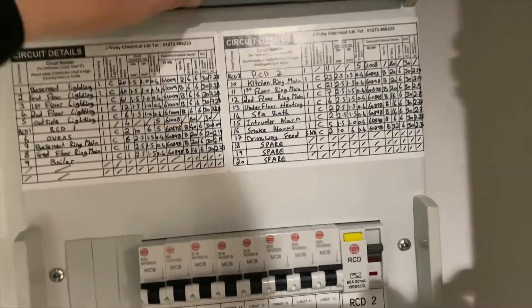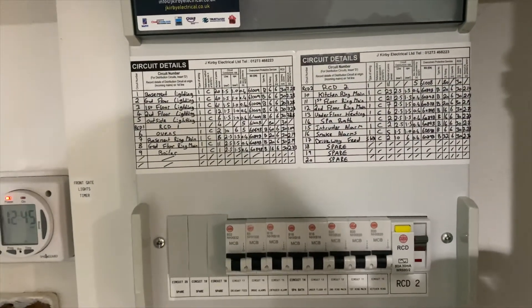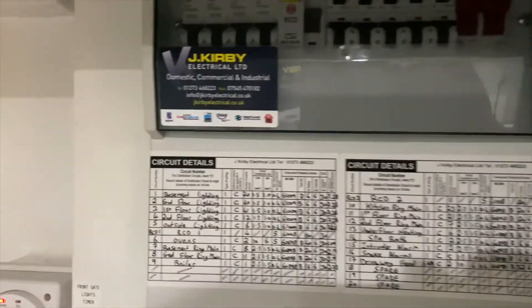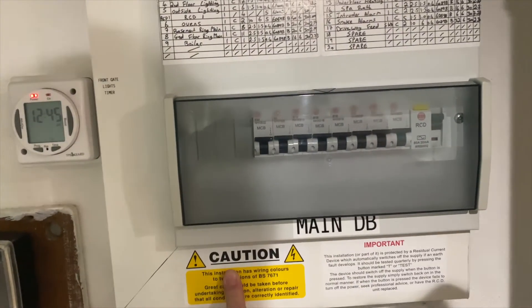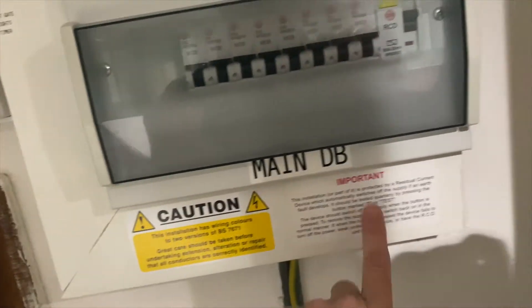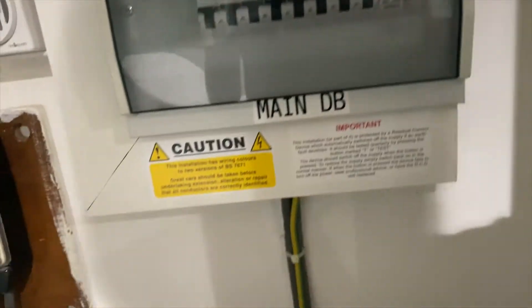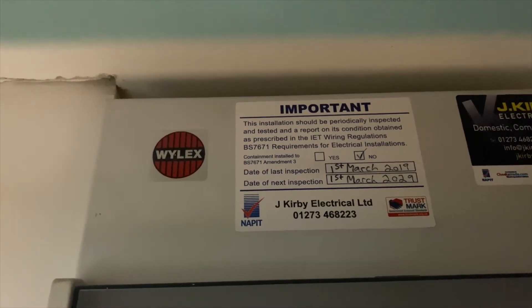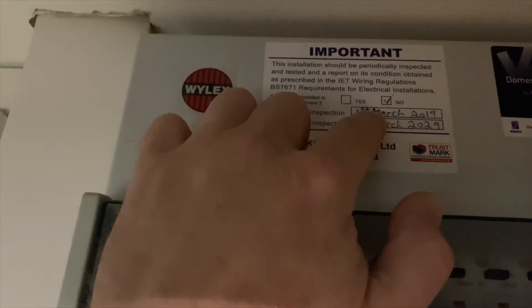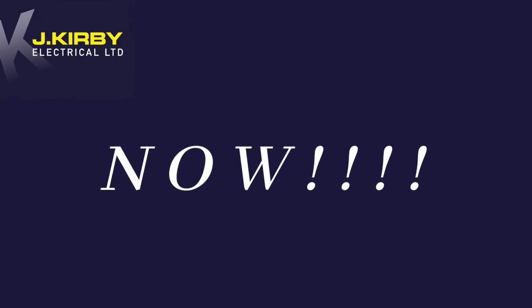If you've had your board done by professionals, you'll notice circuit charts on here — you should always have these because it helps the next electrician understand exactly what's going on. Also, nice stickers with the contact details of the electrician who installed it, a mixed wiring notice if applicable, and a test sticker showing how often you're meant to test your RCD test button — quarterly. Up here is your next inspection sticker showing your initial test date and the recommended retest date from your condition report. I hope you found it useful — please subscribe to my YouTube channel for more helpful videos.